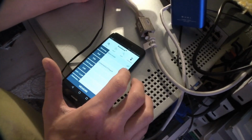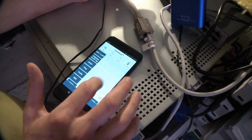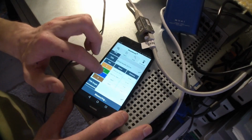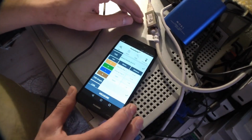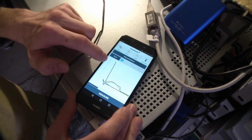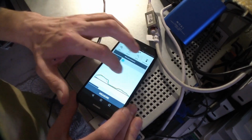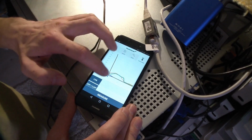Alright, so let's test for TDR graph. No, don't do a link, but we have the TDR test. And now let's measure how good our connection is, how good the cable is. 6 meters, that's not right. It says 11 here, and those pairs are open because, why? Of course, splitter. Or Doppler, we call them in Germany. You know what I mean. Yeah, but they are connected. There's like a really bad reflection here on this cable, always on this pair. But overall it looks okay-ish. The end looks okay-ish, but in the beginning here, maybe this thing is causing a little bit of trouble. But overall it looks good.